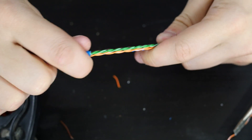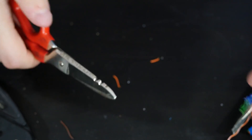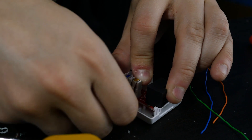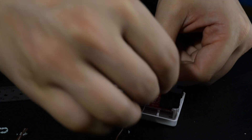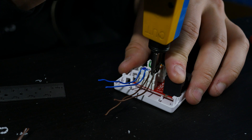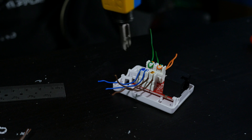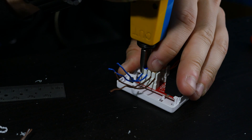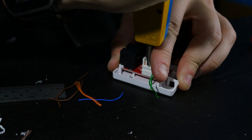We're going to use the single port jack and bridge all of the pairs: the blue and blue-white pair gets bridged together, the brown and brown-white pair gets bridged together, the orange/orange-white and green/green-white are each bridged together. Then using our 110 punch tool — you can do this in your hand or on a solid surface — make sure the cutting blade is on the outside with the loop on the inside, and punch down all of our conductors.